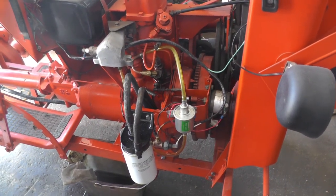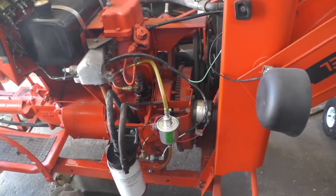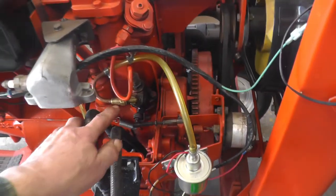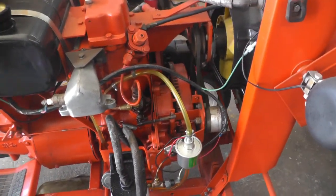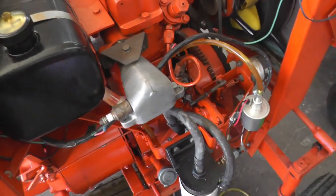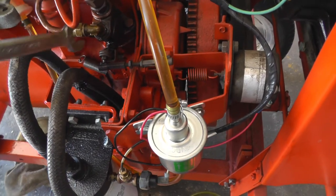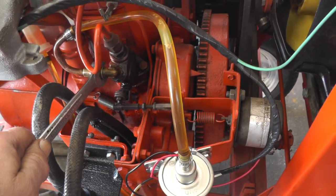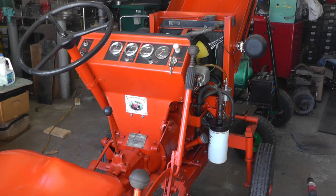I've got her mounted and the lines run. I had to take the air cleaner off so I could get in there to work and get the fuel line hooked up. I got this connection here loose because I've got to make sure I get all the air out of it — these diesels don't like to have air anywhere. So I'm going to turn her on. Looks like we've got fuel. I've already got fuel all over everything, so I'll get that tightened up and fire her up.